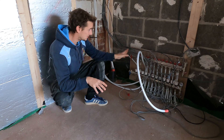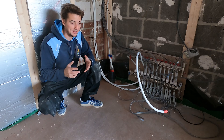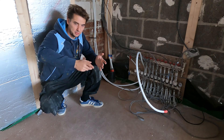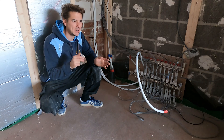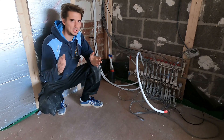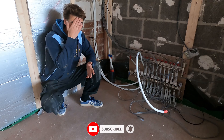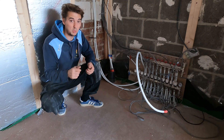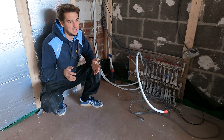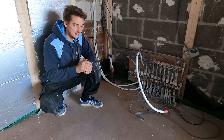For the underfloor heating upstairs I'll put a link to what I've purchased so you've got an idea — including what I'll be doing for the garage, as I've already purchased the boards. The chipboard flooring system is fine if you can control the floor and joist direction from the start. The boards have no flexibility — they only go in one direction — and whilst that works fine upstairs, it is quite painful when you have to dig and cut holes, pull pipes through, and then need to change direction or go around objects like leaving out a bed area.